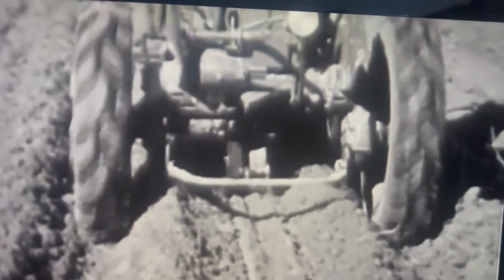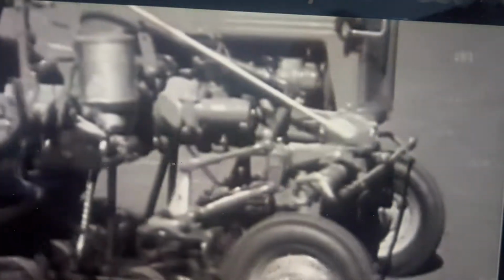In planting equipment, the runner type, one-row planter with correct hoppers, plants cotton, corn, and practically all row crops. Also, there is a shovel type, blackland planter. Fertilizing equipment can be used with either. For universal use in vegetables, there are multiple row planters. Here, forward-mounted equipment is planting four rows with 12-inch spacings.